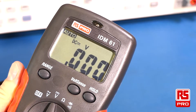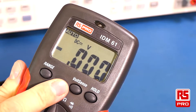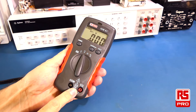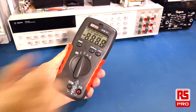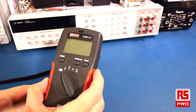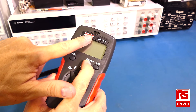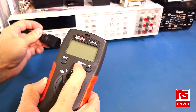The RS-PRO IDM61 has a handy feature called VoltSense. This feature allows you to sense any high AC voltages present on wiring that you may be working on. It's best to use this feature with the test leads disconnected. The feature can be used with the multimeter in the off or on position. To use the function, press and hold the VoltSense button. A red light will tell you that the feature is activated. If you have a high voltage AC source present, it will alert you by sounding an alarm.